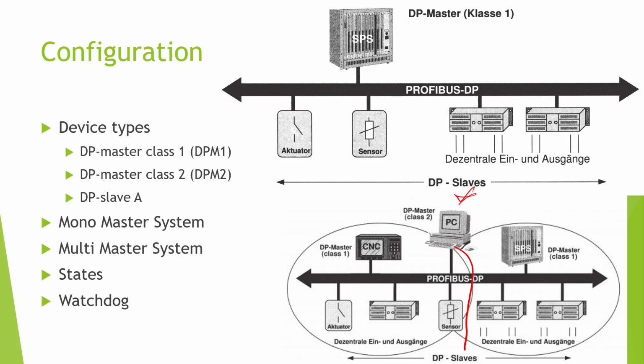In the world of electronic stuff, especially small embedded things, a watchdog is maybe a little chip that you pulse high every second. You send an output that goes, hey, I'm here, I'm good. And as long as that watchdog is getting that pulse, it doesn't do anything. As soon as that watchdog stops getting that pulse of I'm good, that's when the watchdog jumps in, pulls the reset on the device low or high or whatever the case is to turn anything off, waits again like half a second to a second, lets that line go, and then gives it 30 seconds to a minute to maybe reboot to make sure everything's operating correctly again.